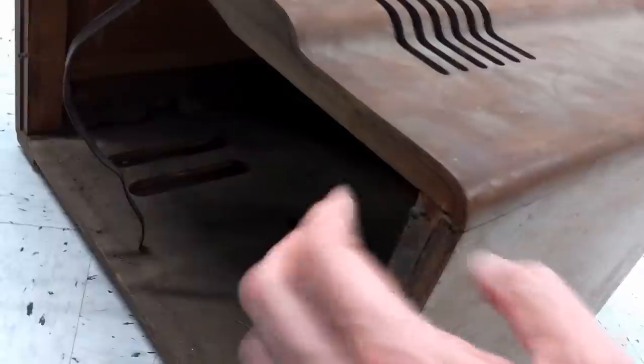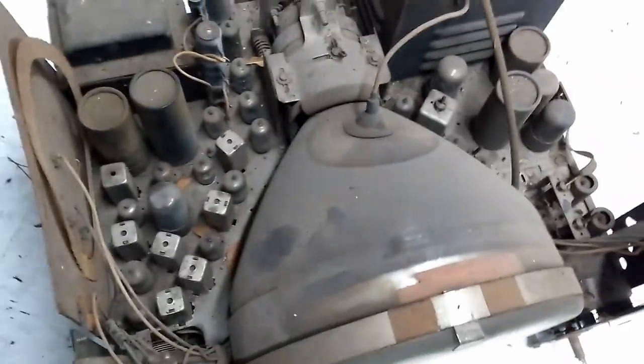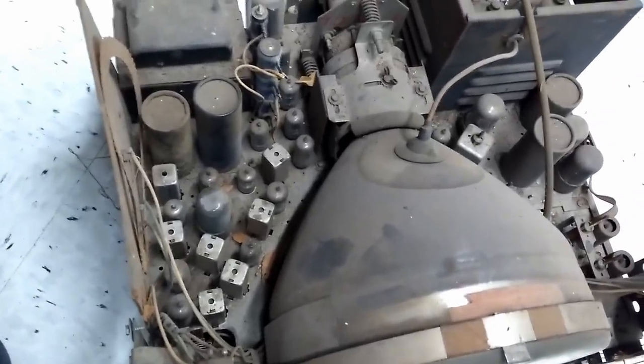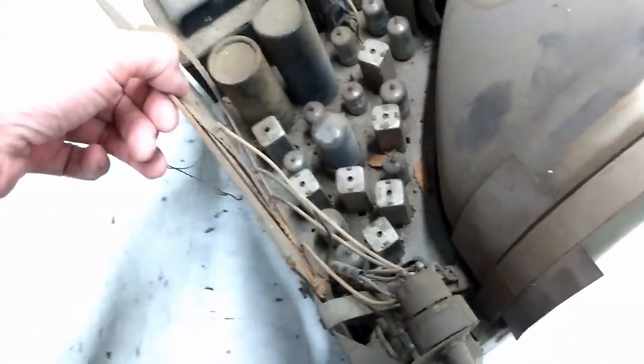I guess this set must have had a back because I can see there are screws here. I don't have it, but it has a separate CRT socket protector — a metal cup. There's no cover for the high voltage section; that might have been integral to the back. It kind of looks like an early RCA chassis, the 630TS, with the way they had a big cutout for the CRT and fit the circuitry around it. This is a built-in loop antenna which got a little bit damaged but it is there.